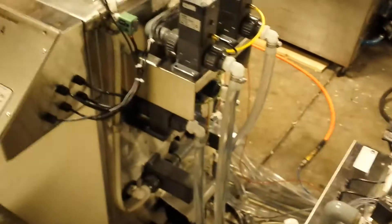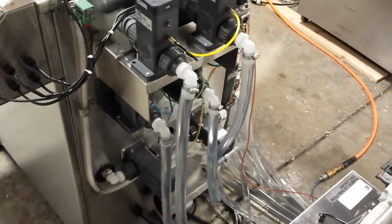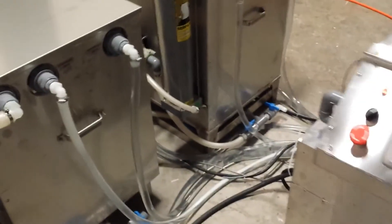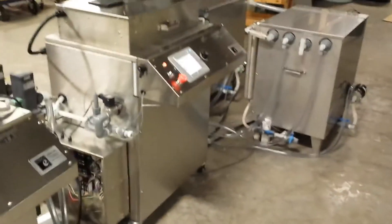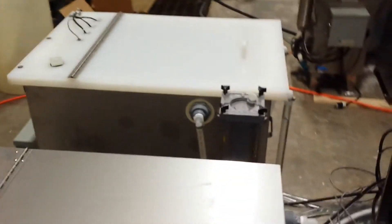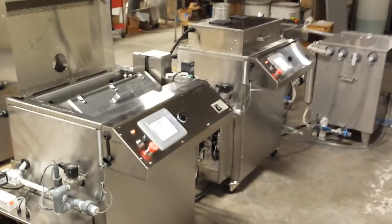The system uses mag drive pumps, including chemically compatible ones, and the valves are CPVC and they're air actuated. The hoses used to connect the machine are PVC hose, custom lengths, so the modular system can be configured in whatever way fits the building or room application. So that's the E992 passivation system — the dual process system using two process units with one set of storage tanks.